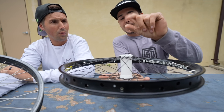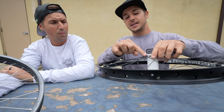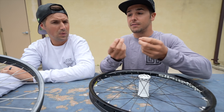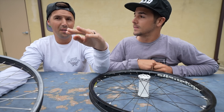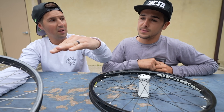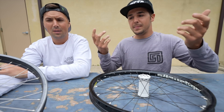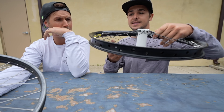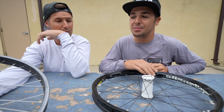With a normal BMX flange that sticks out, there's no support underneath, so the plastic doesn't adhere well. The plastic comes out hot and if there's nothing supporting it underneath, it'll droop down or fall. So if you build everything standing up, you have to come up with designs that make more sense for the 3D printer.